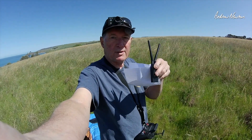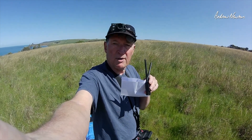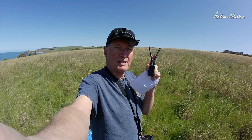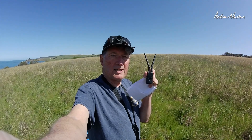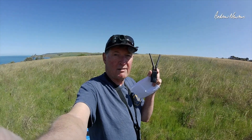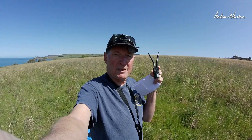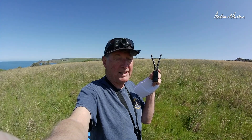It is a dual frequency RF module. It has the option of Gemini mode which appeared in ExpressLRS about a year ago. It runs on 3.3.0 and Gemini mode means it is actually two RF modules operating at the same time in slightly separated frequencies, which kind of doubles the link security. Your link quality is going to be sitting on 99 to 100 no matter what you do, so it's just going to enhance the already amazing link quality and range of ExpressLRS — this takes it up to the next level.